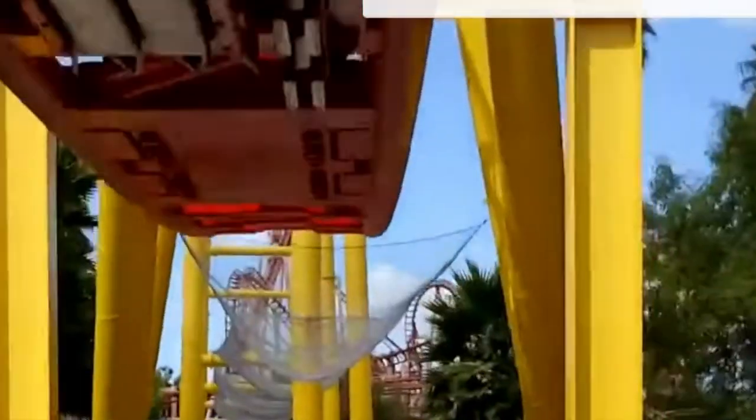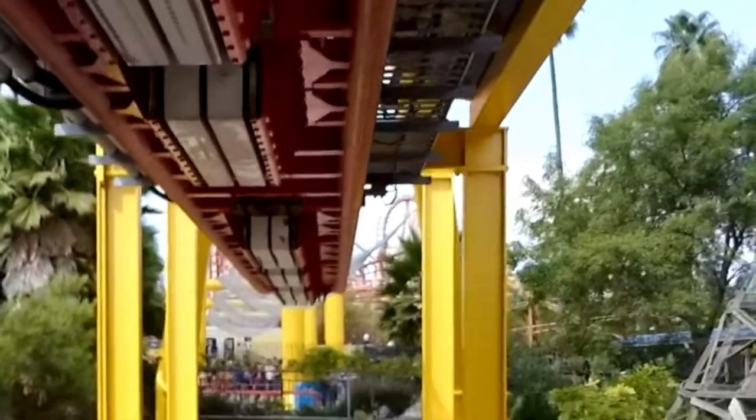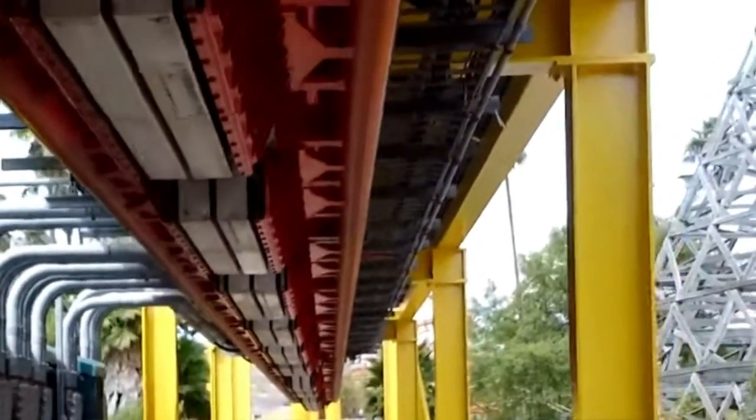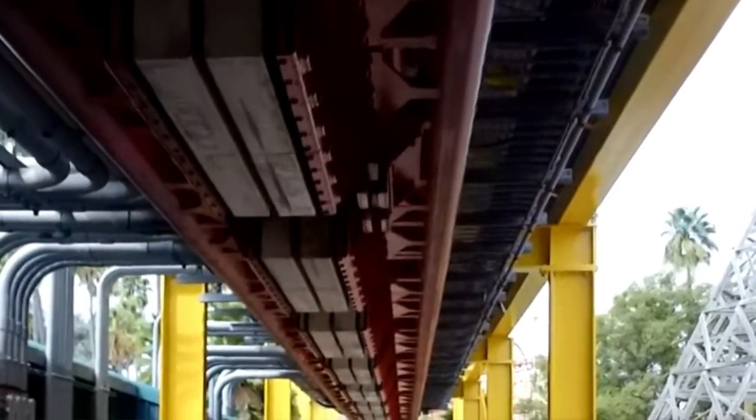It's making all sorts of sounds as the thing's coming to a home. And you sit there and you're not used to it. You sit there like, oh my gosh, what is this thing doing? But it's using high current at a very low frequency, just trying to nudge 14 tons of load on the track, which is not very easy to do. And remember, it's got to stop in 4 millimeters of space. That's the width of the screwdriver. That's where it has to stop the train each time. Not easy to do.